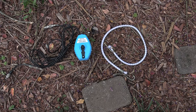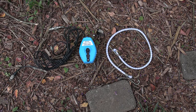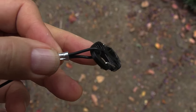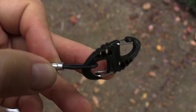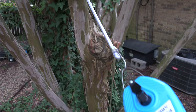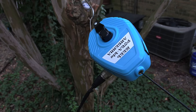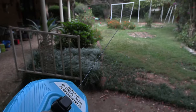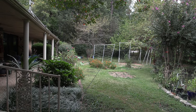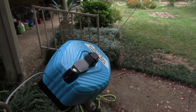Here are the tools we're going to use today: the Real POTA antenna, a hunk of coax, and a bungee cord to secure the end to our tree. The end of the wire coming out of the reel has a nice handy dandy clip, making it easy to hook onto whatever you're pulling it up to. Here's our lash-up in the backyard — a bungee cord over this crepe myrtle tree, about a 20-25 foot hunk of coax. They suggest 50 feet, but a little jumper cable worked fine too. They suggest the sloper design, popping it up over a tree at about 20-25 feet — pretty typical camping arrangement. I used the David and Goliath method with a rock and a string, wound it around fast and threw it up over a branch.